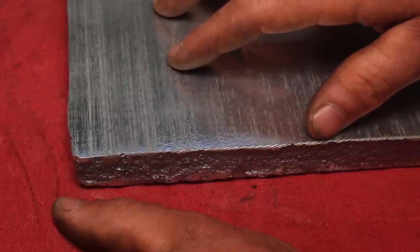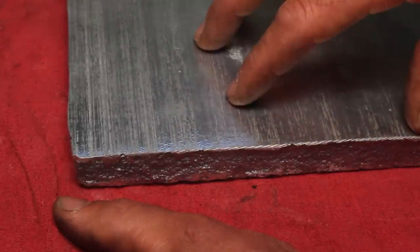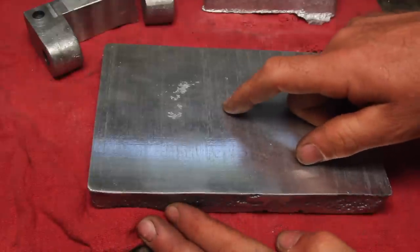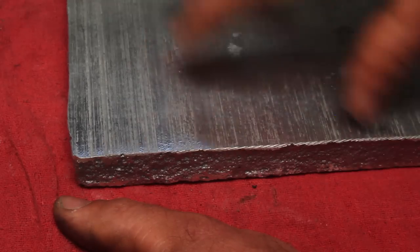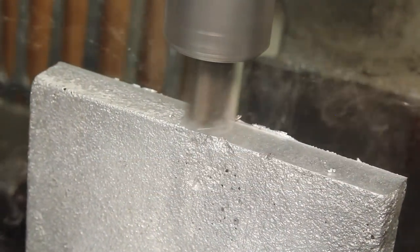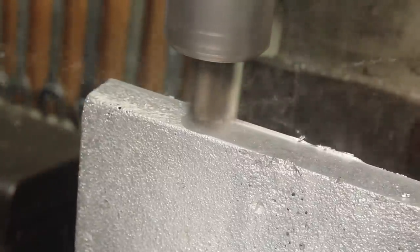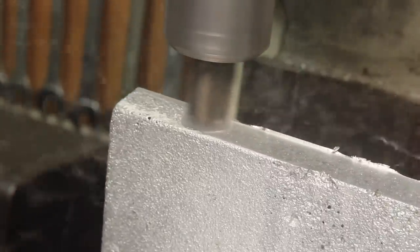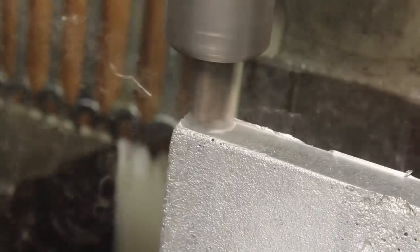One of you left a video link in the comments previously to Flowering Elbow doing a heat treatment. Guess where I left the link to that? Yeah, it's in the description. So I tried heat treating this, and we'll see if it's any better. The heat treatment was 350 degrees Fahrenheit, about 180 Celsius, for about 5 hours. I'm honestly not expecting much, but eh, for science.